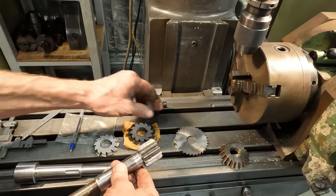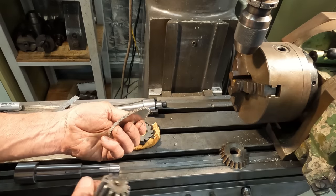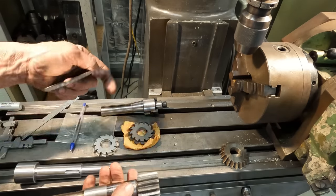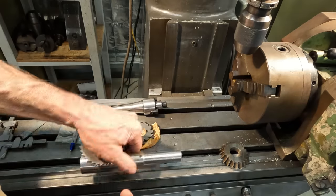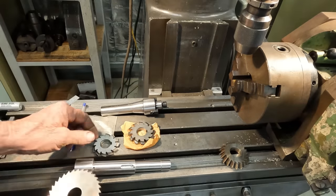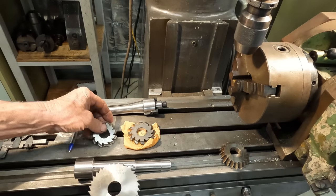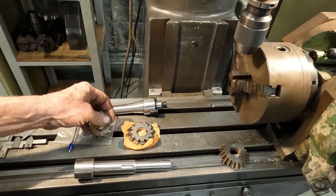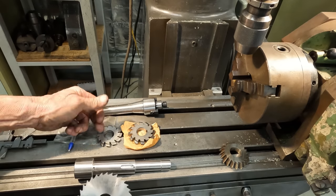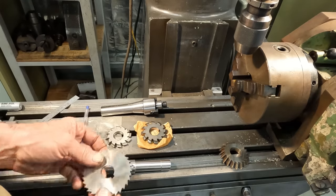The other reason for trying to bulk a lot of it out with a slitting saw is that the material on the new shaft is a very tough material. So it's not going to be that friendly on these cutters. I just want to virtually be doing a finishing cut with these two cutters. I don't want them bulking out material, as a slitting saw is cheaper to resharpen.